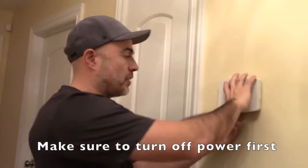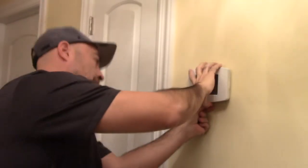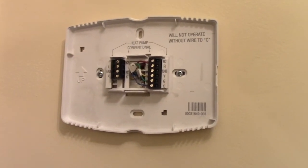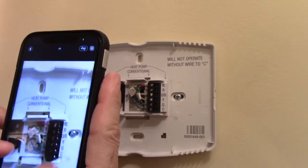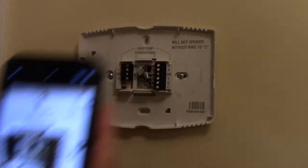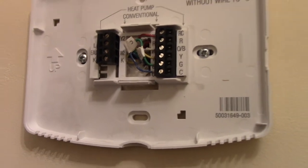So let's take a look at the wall. Here's the thermostat I have. The first thing we need to do is take this one off the wall — make sure your power is off and your unit is off as well. This one pops right out. I'd suggest you take a picture of the wire setup so you remember how everything goes. As you can see, I have that C wire — the blue wire going in there.